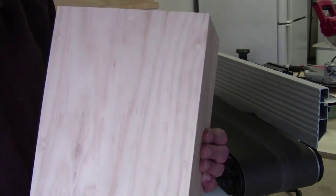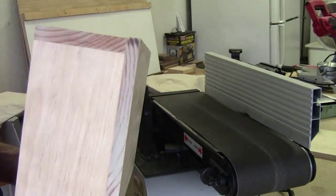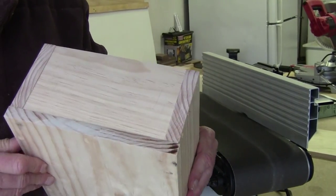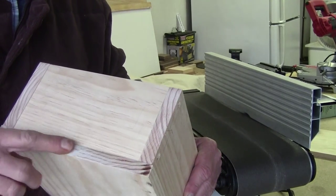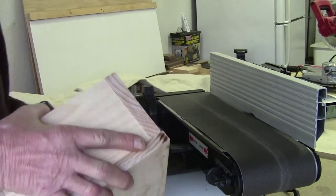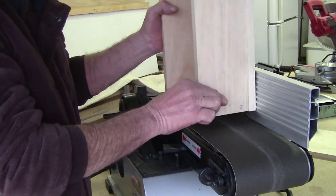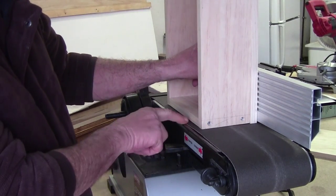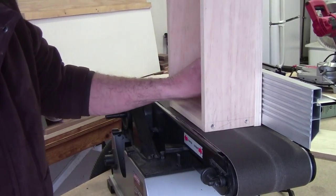All the plugs are sanded down with 120 from the belt sander. Next step is to start sanding off the ends - this is the end grain here, the grain is running this way. End grain can be sanded either direction, but we want to sand with the grain - real important. Hold it back on the fence; see how it tilts if you stand it first. You don't want it sticking out further back, so hold against the fence and start sanding.